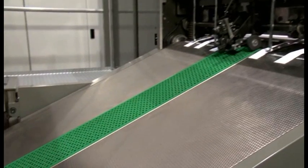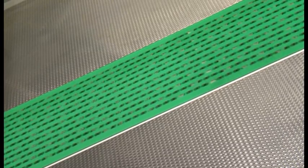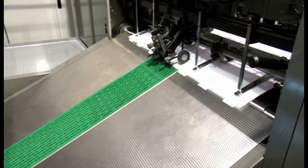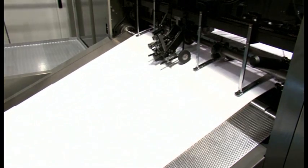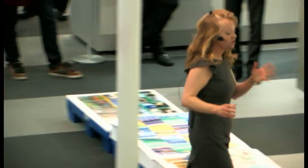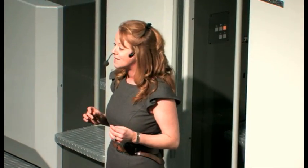The guide for the brushes and roller on the feeder board has been eliminated, and a design with a single suction tape in the middle has been adopted. This further restrains sheet bending and lifting. This suction tape ensures stable sheet travel accuracy because the speed timing of sheet travel is significantly reduced, meaning adjustments the operator must make when changing paper grade or size have been substantially reduced. In the current job changeover, the sheet thickness is also being changed to 0.31 mm, but the Lithrone G40 can print carton board up to 0.5 mm in thickness without any transfer cylinder gripper pad height adjustment.